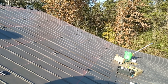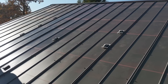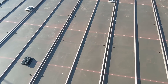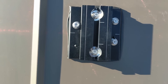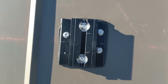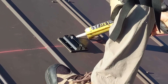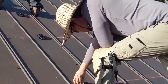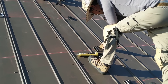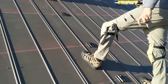Hey folks, Engineer 775 here — this is a fun day working with the crew. We're always trying new products, and the latest is the Roof Tech Mini. Look at this base — it's kind of like the QuickBolt but for a metal roof. It's got a butyl strip underneath, you can put five screws in, and you don't have to hit a rafter though it's always preferred. Johnny's following the manual to the tee and caulking around it — he even brought bronze caulk. Antonio is just setting up.